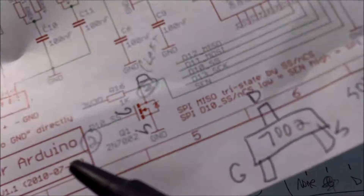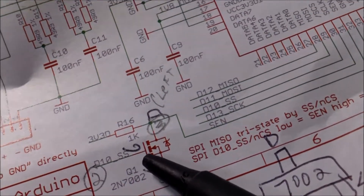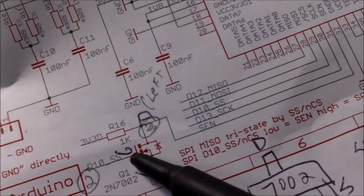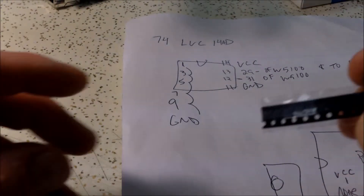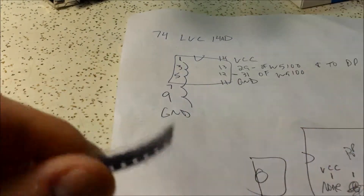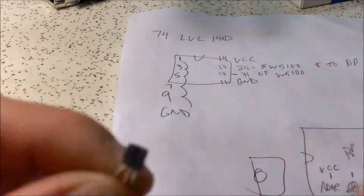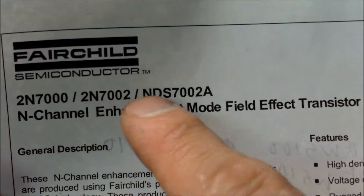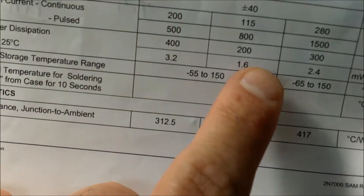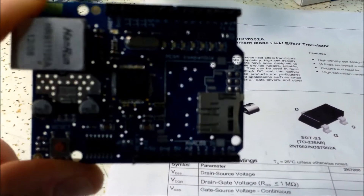There's a resistor that holds the line high. The nice thing about this N-channel MOSFET is that when you select it high it stays high until you actually make it go low, so this is the perfect solution. You can use any SOT-23 variant of your choice. I have some little SOT-23s of the 2N7002, and I also happen to have a 2N7000. The datasheet shows N-channel enhancement mode field effect transistors - the only difference between the 7000 and 7002 is the maximum drain current, which doesn't matter for this Arduino shield application.